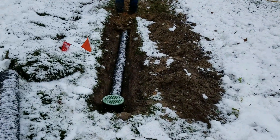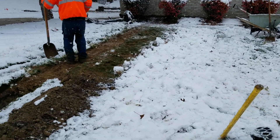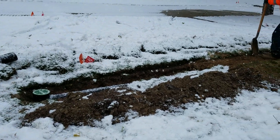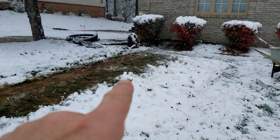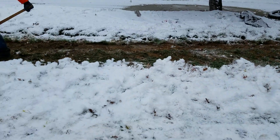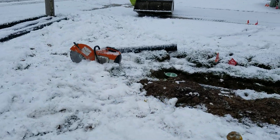We have some dual wall ran right here to a six inch catch basin. We wanted to empty this pipe out, so we had to go — it's actually a really far run. We want the pipe to be completely empty, not holding any water, so we want it to fall. We shot this with a laser level. All the topos right through here just read flat, wasn't getting any fall. We took it under the walk and finally the grade broke, so we got enough break to empty out that pipe so it doesn't hold water.